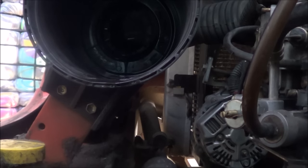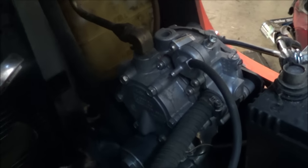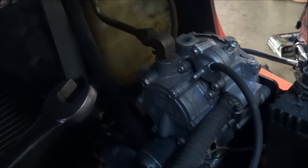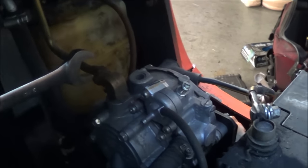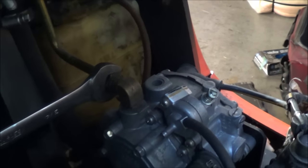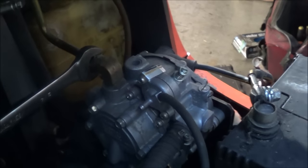So now we're going to go after fuel supply. We're going to check if we have good fuel supply. This line is the one coming from the tank — first make sure that the valve on the tank is open. Once I confirm the tank valve is open, I'm going to crack the line and see if there's pressure going into this regulator. And there you go — I know there's fuel supply going into my regulator.